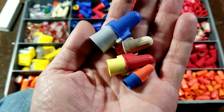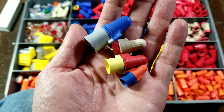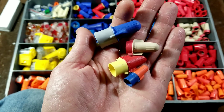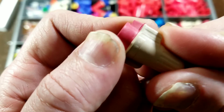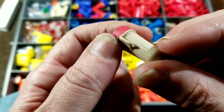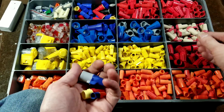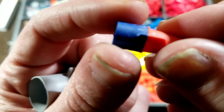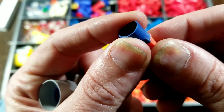Here are all these premium grade 3M wire nuts. Some of these are, for a wire nut, outrageously expensive — 50 cents, 75 cents for an individual wire nut. But as they say, you get what you pay for. This red size here has a rubberized overmolding to relieve tension on the wire, and they just have a beautiful build quality with really excellent oversized thick coils inside. They also have this style, which I assume is PVC but has flexible, deep integrated strain-relief boots.